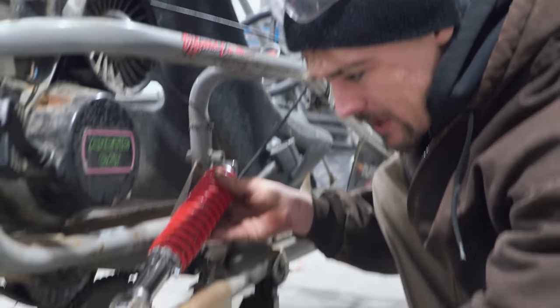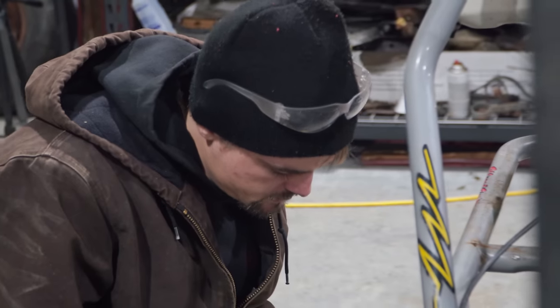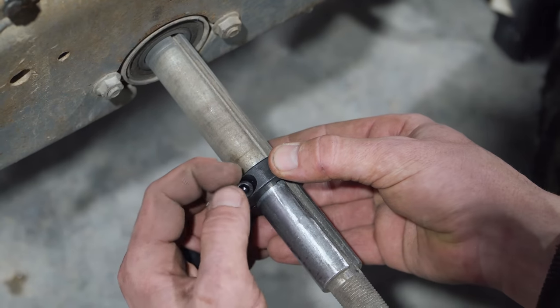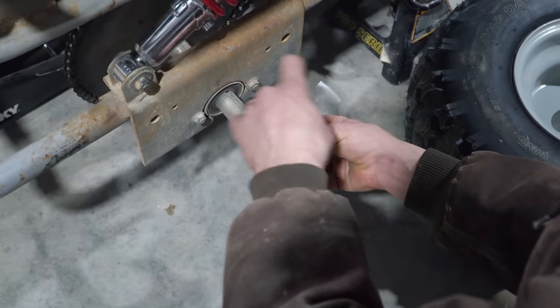And we're gonna cut spacers to go here, so the tire can't walk this way. I don't know if that side's gonna have the same mark, but this one's already got a mark. I'm putting it back where it was. Oh, where the old hub was, right? Yeah. Okay, that's fine. I'll do that too. I'm gonna offset the keyway on the collar so the key can't slip out the back.